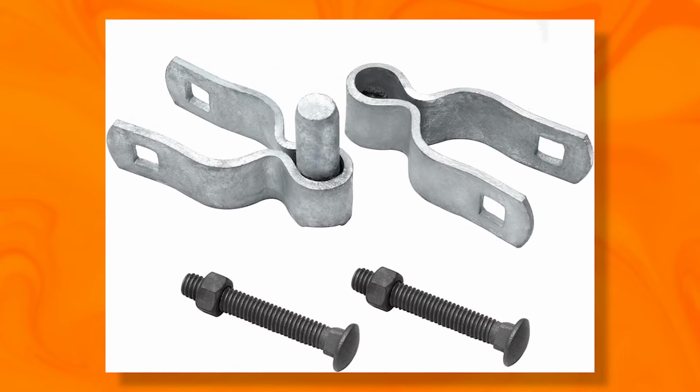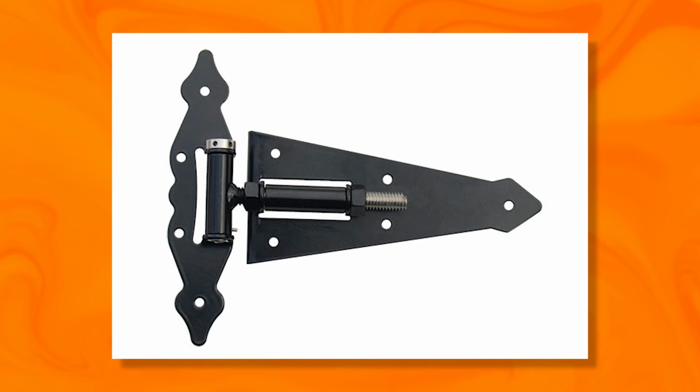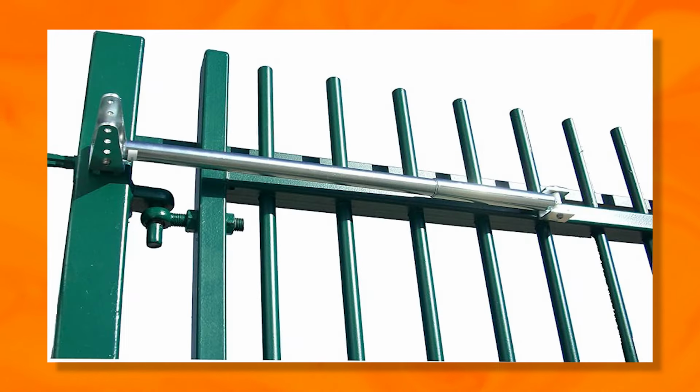So as you can see by the demonstration there, the butterfly latch self-closes when you swing it in the closed position. And they're really handy for particular applications. Now, this particular demonstration that we have set up for you guys, we're just using regular male and female hinges. Typically, when we install butterfly latches, we're using some sort of a self-closing device, whether that's self-closing hinges or adding some sort of a shotgun closer or the TB175 or some sort of a hydraulic gate closer.